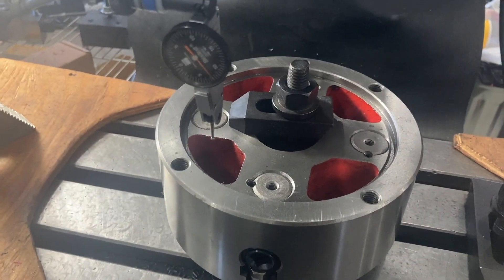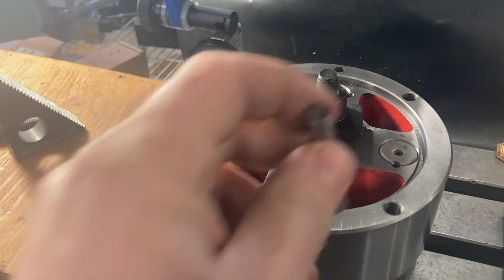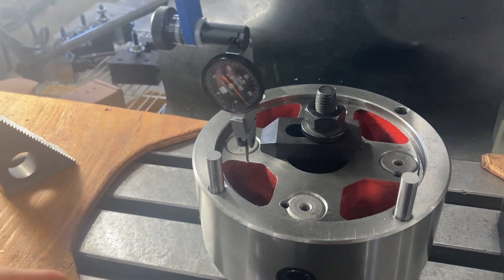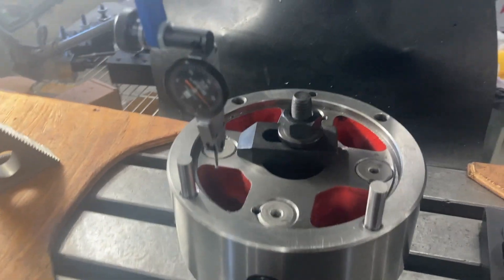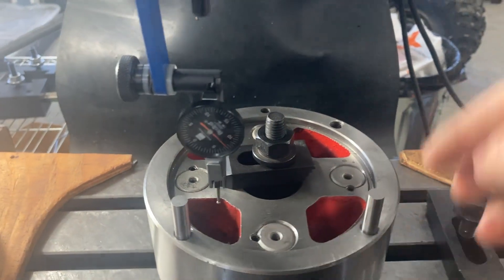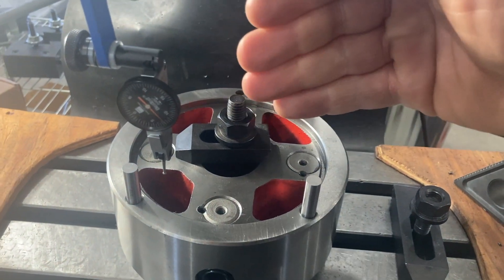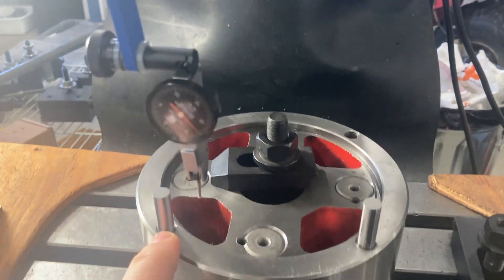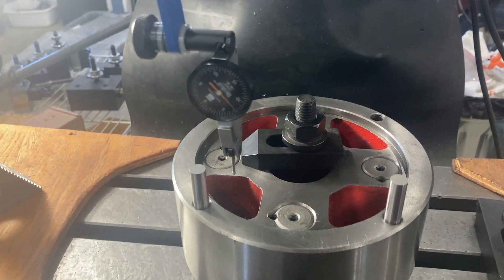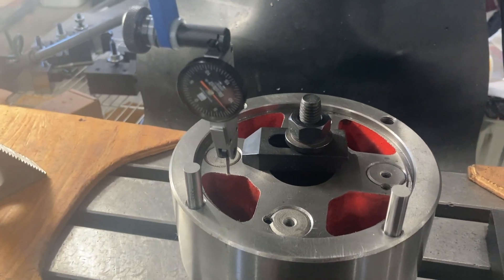The first thing I've done is take a couple of gauge pins to put into the holes. They fit nicely — not super tight but a good fit. I'm going to orient the part so that I have a mirror image: drawing an imaginary line through the center of the part, I have a mirror image front to back. I'll use these gauge pins and the indicator to align it, just like I would align a Kurt vise on my milling machine table.